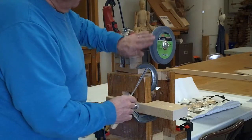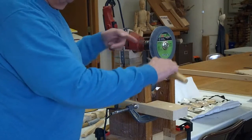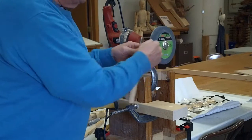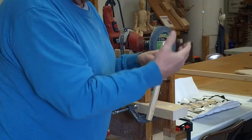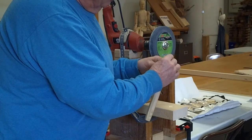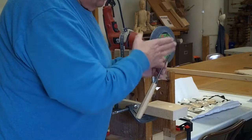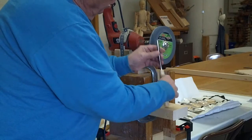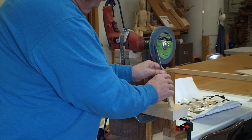You don't want to use the round part of the wheel. Maybe you could come across like this to use the flat part, but you don't want a hollow ground. This curve on here would make it a hollow ground, and that kind of works against you. Because you need a little bit of the angle down here as the fulcrum of the lever to bring your tool out of it. So hollow grinding works against you — using the flat side of the wheel is going to work just wonderful.